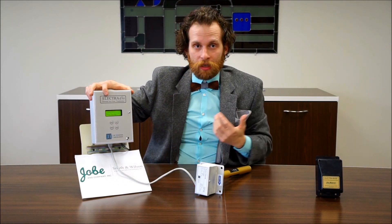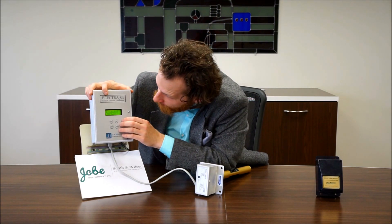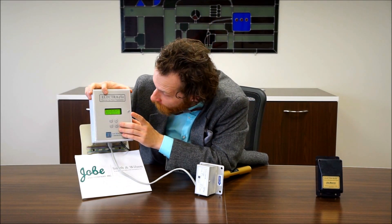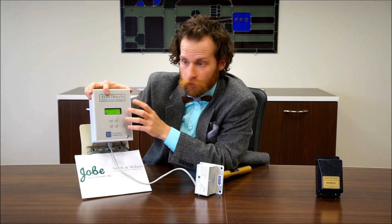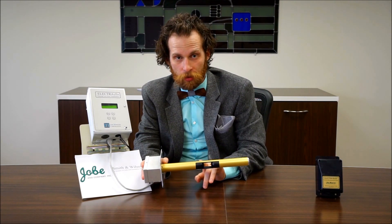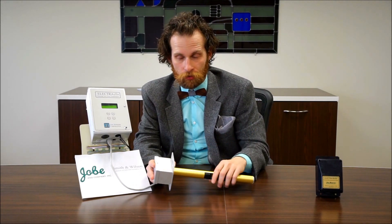We're going to connect it and turn it on, and it's going to say 'Thank you for choosing Air Monitor.' It's currently telling us it has found one sensor — one of one. The first time you set this up it goes through a warm-up process, and the reason for that is these are matched thermistors. It heats one thermistor in order to measure the temperature and then the temperature difference as air flows through it.